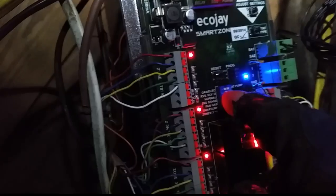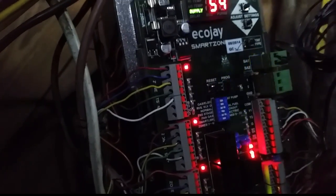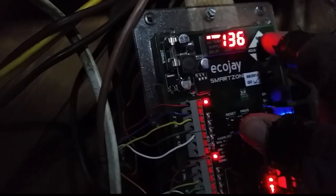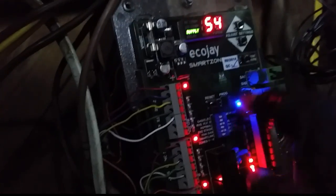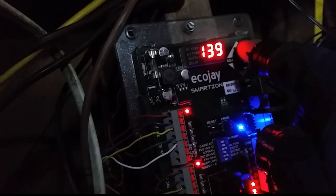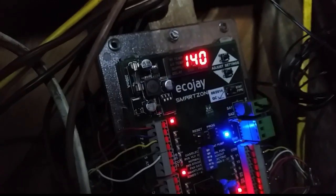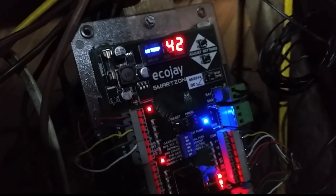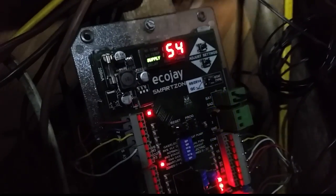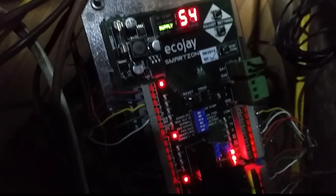We have a heat pump dip switch set, but I'm actually going to put that back to gas/electric for a moment so I can adjust the high limit. We can go up to 135 or 140 if we want — we'll leave it on 140 high limit. Then we'll push our low limit, which defaults at 48, but we're going to go all the way down to 42. With our variable speed blower, we don't want to be caught off guard with the low temperature setting while it's ramping up during cooling. Then we put our dip switch back to heat pump, and we can start things up now.